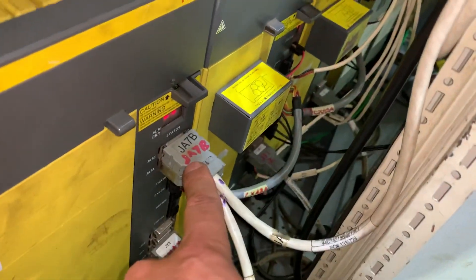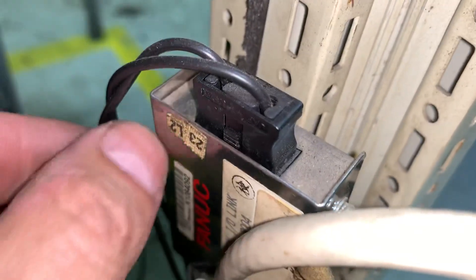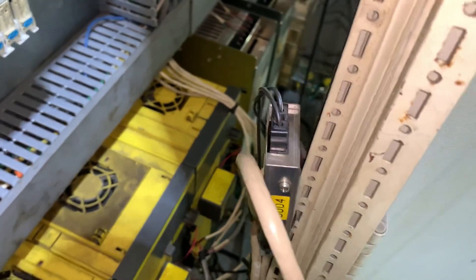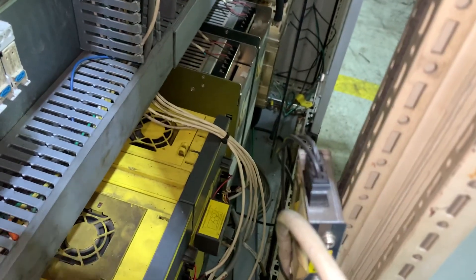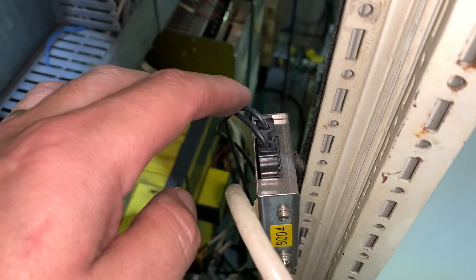What you need to do on the drive is to check this connection: turn the power off and disconnect the optic cable from the clip right here, remove it, and you need a clean cotton swab — or there are some kits available on Amazon that you can buy — and clean both ends from here on the CPU. You can also buy a scope to check the fiber optic cable, and that scope is going to tell you the condition of the cable.